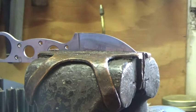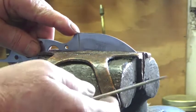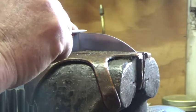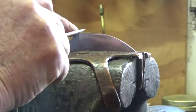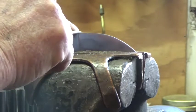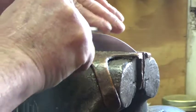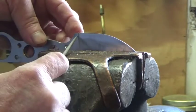I've got two grades of these diamond files — one's rough and one's fine. I just get my finger there as a guide, and if you're in doubt, you can certainly put the filing jig back on that we ground this to. You don't try to take too much at once, and you start going across — you're just doing a little semicircular indentation. Because it is a radius and not a V-groove, you don't have to worry about that turning into a crack at heat treatment. Once you've got something established, just start taking cuts across until you feel it's deep enough, right where the plunge cut starts.